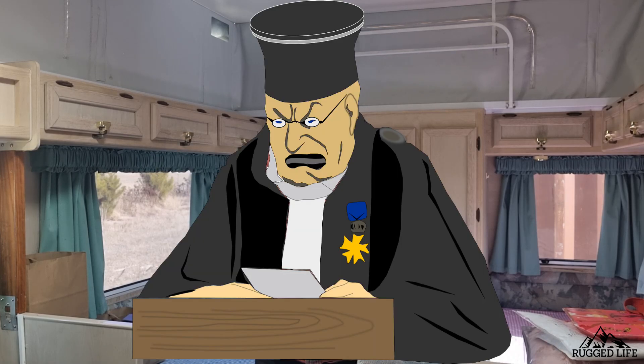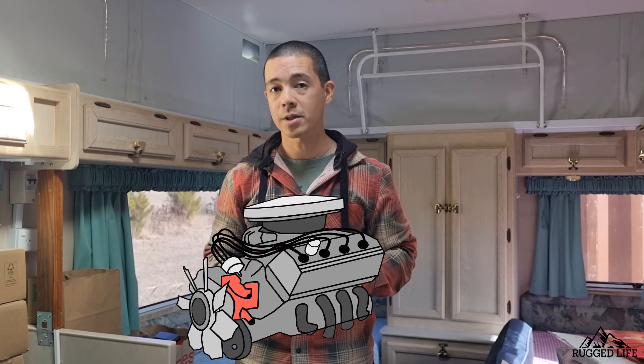Just a side note: here in Australia, there is a law that if you're running a battery in your caravan, it needs to be in a sealed box isolated from your living space. Now, let's move on to the charge controllers. To keep it simple — think of the power coming off the grid or from the sun into your solar panels as your fuel, your petrol, your diesel. The charge controllers are your fuel filter, and the battery is your engine. If your filter can't filter dirty fuel properly, you'll end up with dirty fuel in your engine. What I'm trying to say is: as much as you can afford it, spend money on quality charge controllers to preserve the life of your battery.